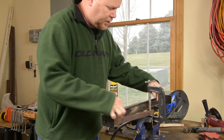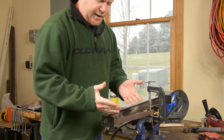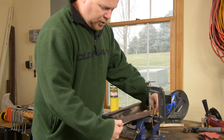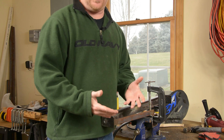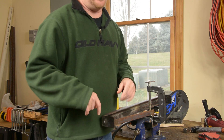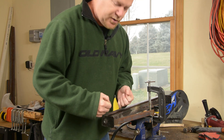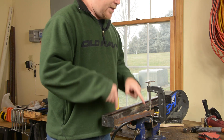I have the first cross brace for the back cut. It turns out to be about a 10 to 15 degree angle — frankly I didn't measure it. I held this piece up, marked it with a marker, and just cut it, because I need a little gap for the weld anyway. Prep is everything. Welding and paint are the two places where your preparation time will pay off in spades. I'm going to move the camera and try to get a decent arc shot, which probably won't work — worst case scenario, I'll see you on the flip side when this is attached.